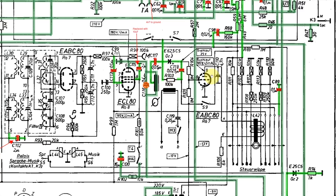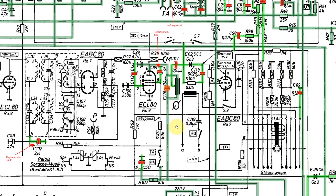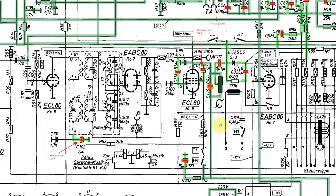After all that, I changed quite a few capacitors. All the caps that needed changing on here were changed, with the exception of this motor capacitor — that one there, which is 0.35 microfarads. I think it's fine and I don't have a spare one. This orange one was also changed. Everything else I had not checked and I was really just hoping that by replacing the caps and putting in the tubes, this thing would work. But it doesn't. So let me show you what it does do.